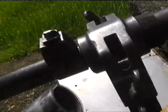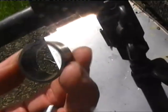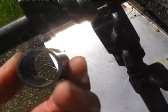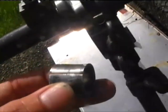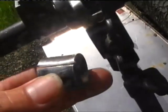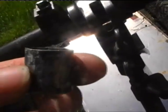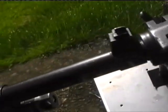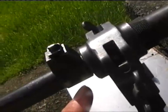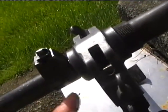So I'm going to get on with that. The piece of piping that I've cut to make my bottom tube was a piece of one inch piping, and I've just cut the part of the side out of it and closed it up so that it's the right diameter. Then I'm going to weld this top part of the sight over the top of the slot. To mount it on the actual barrel, I'm going to grind or cut a slot in the bottom of this and weld it through to the underneath of the barrel once I've got it all in alignment. I may just put a temporary weld on there, and then when the gun is finished and I'm able to start trying to sight it, then I might weld it up properly.